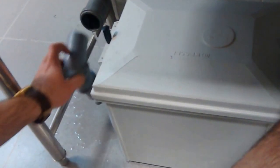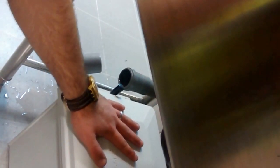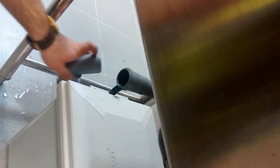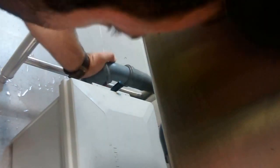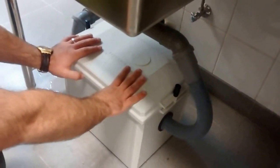The most important thing is also at the outlet, we need to make sure that it's cleaned from any residuals. We need to make sure this is clean in order to have a 100% watertight system, and at the same time, in order to have a hygiene medium. So once this is clean, emptied, everything is okay, we just come and center it. As you can see, it's very easy for installation since it's a rubber plug, access plug. We just drop this one inside, push it a little bit, then like this, we are okay. Then this is the inlet, we just bring it, push it, we are okay. It's a 2-minute job, very easy to access, very easy to maintain, very easy to reinstall again.